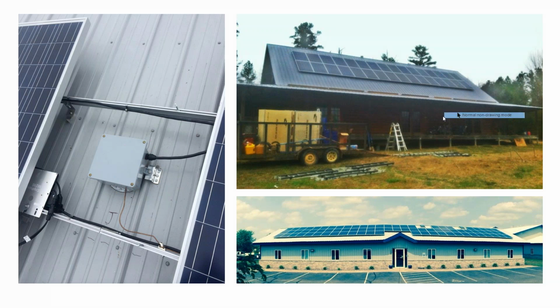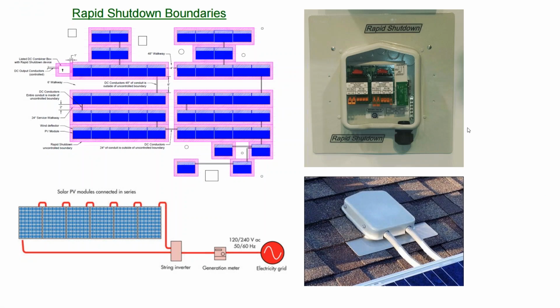So, when you're ordering your specialty material, this is a very popular box called a Soladeck. It's actually made in the same town where Half Moon is located. And you can see it's a lower profile box with integrated flashing, and that's the more professional product.